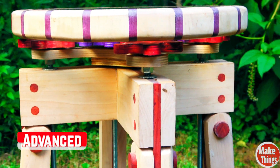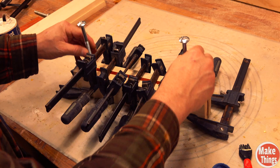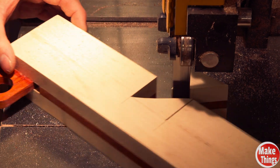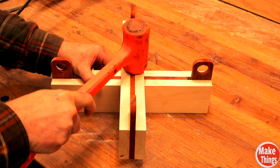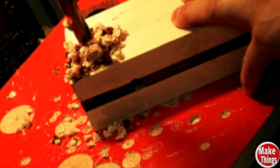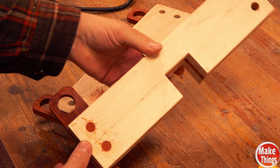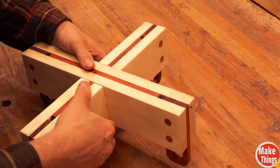The base on the advanced version is two sets of five boards that are glued together using bolts as spacers. Both arms are now cut in the center and will combine to form the X by a half lap joint. Because of the mixed grain direction with the hooks, I added dowels on all four ends. Glue was added and our base is born.